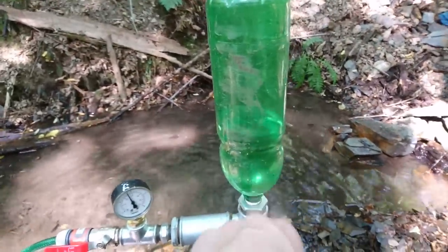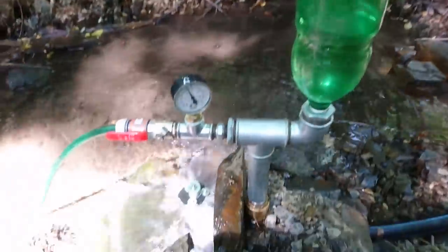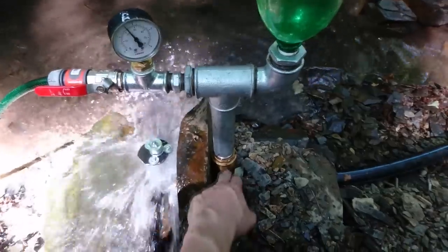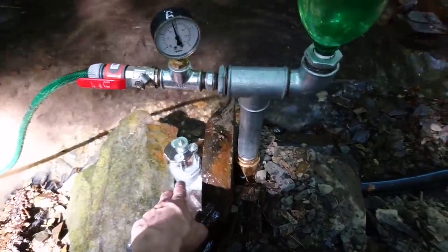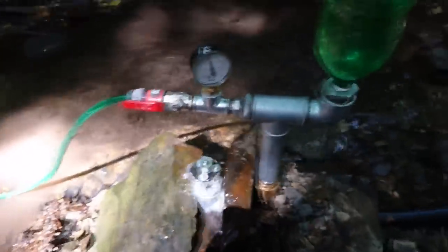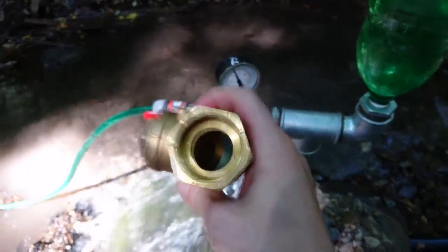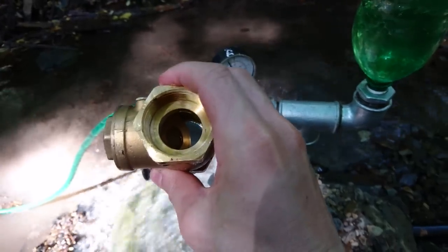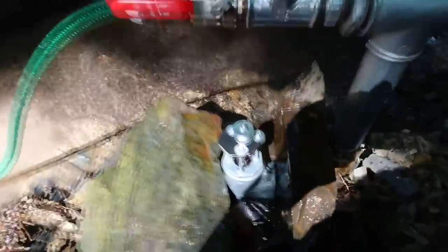As you can see, we have here a pressure tank — that's a very temporary one because I haven't found any better. Very important things are those two check valves. This one I bought; it's quite good quality. Originally I had here my swing check valve, but I wouldn't recommend it because it has restricted water flow and the efficiency is very bad because you can't put any weight on it. So I have done my own.